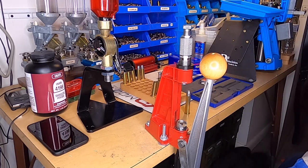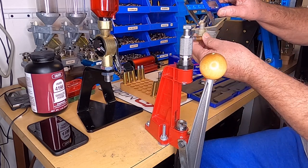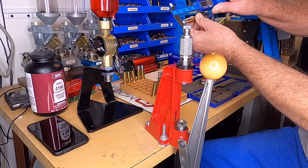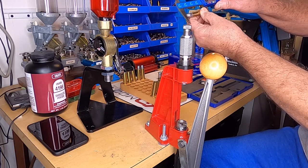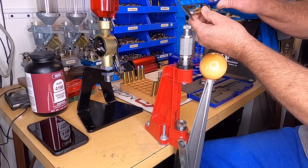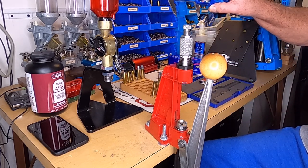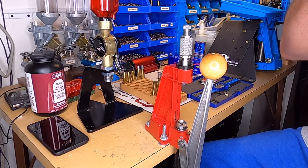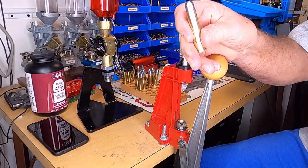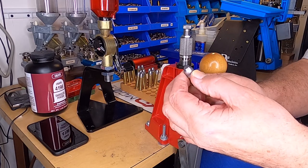Take your calipers — the overall length is supposed to be 2.550 inches. Let's see how close we are: 2.539 inches. We're going to be a little shy of 2.550, which is the maximum length. We're going to be a little under because all these cases were ten thousandths under — add ten thousandths to that and you're still going to be under your maximum overall length, so we're in good shape. In a matter of 15 to 20 minutes you can see we've got some rounds loaded and we're ready to go.